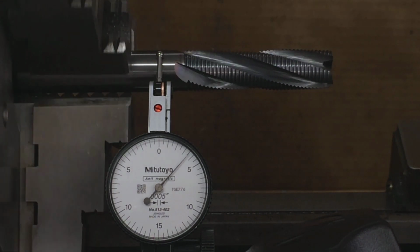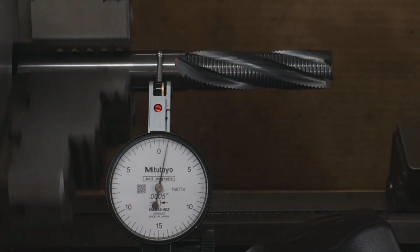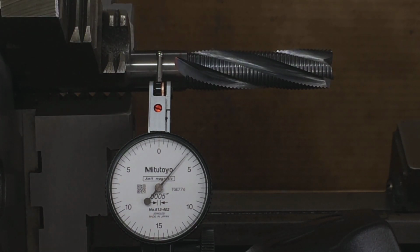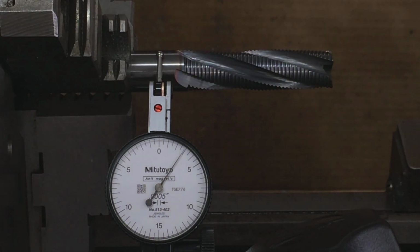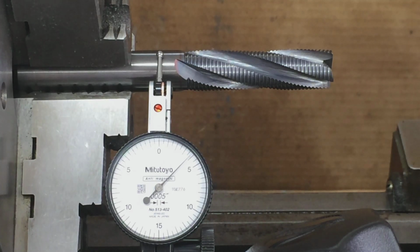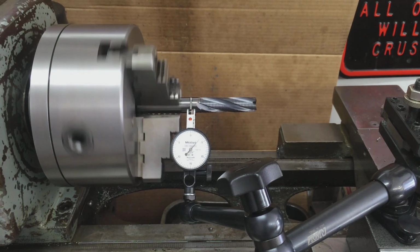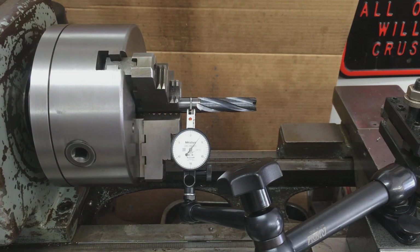Okay, 4, let's see, 4.5. It's 4.5 out. So our jaw grinding ring is going to come in handy for the Clausing. This is an import 3-jaw chuck that I machined the back plate to fit this threaded spindle. So I never even checked the runout on this in the 2.5 or 3 years that I've had it. So it's time to give the Clausing a little attention.